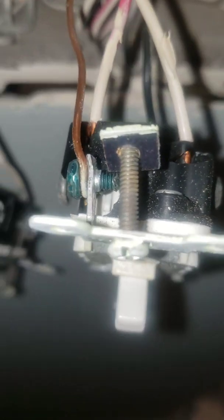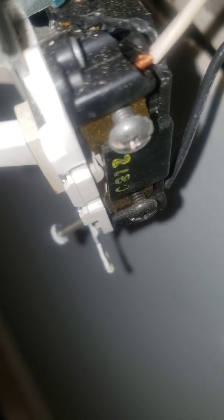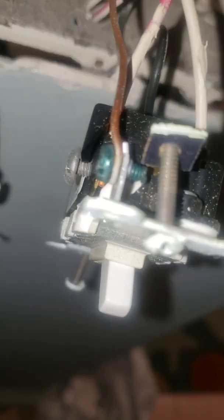I'm going to start a multi-part video doing a re-device of an entire house, showing you how everything is backstabbed here including the outlets. This three-way you can see is already cracked and falling apart because of backstabbing. I'm sure this got hot with the type of lights in the kitchen and the plastic started cracking, making the wires even more loose.